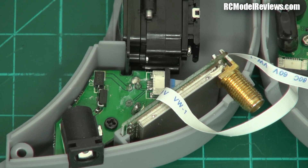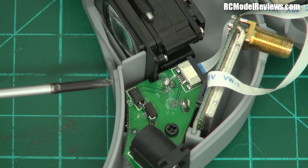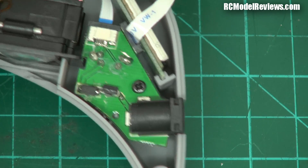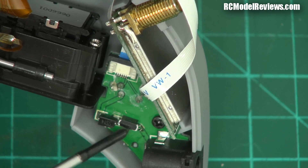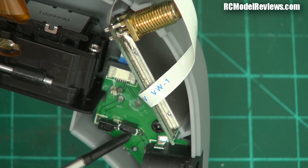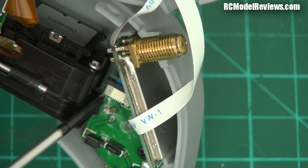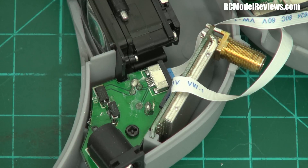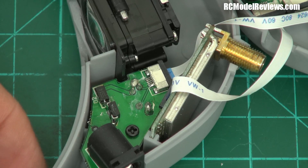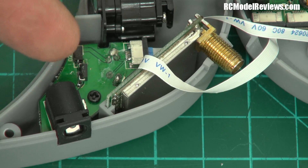In here is where our power comes in. There are a couple of diodes and some bodge — look at this. I've got these surface mount components up on their edges. Why have they done that? They've used a different device to the one they designed for the board. That's not good. Perhaps this explains why my system boots up badly all the time. And this soldering here is a bit shocking. I don't think this was a prototype — I think this was a production mod. In fact, this was an updated version, not the very original version. So there's really no excuse for this kind of thing. These are still an expensive piece of kit, and I'm disappointed in the attention to detail in here.